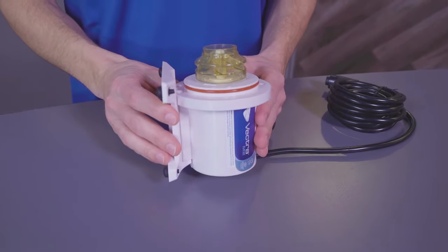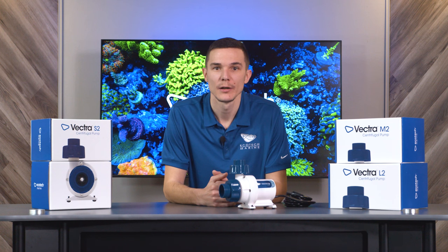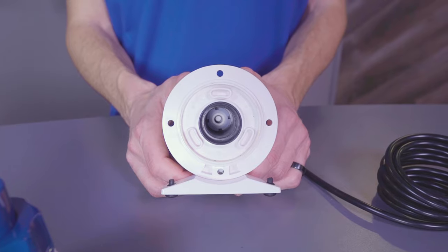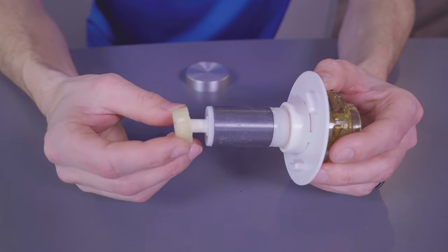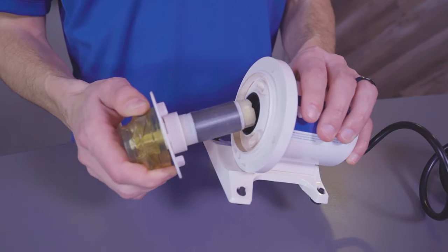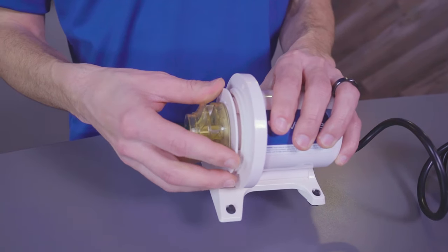If your pump is clean and you are still receiving a stall error after reassembly, please check the bearing in the back of the pump. To do this, you will need to disassemble the pump again by removing the four 5mm Allen screws from the pump, then remove the Volute and the impeller. The bearing is located behind the impeller towards the back of the motor. This bearing is directionally specific, so you want to ensure that you have the bearing seated correctly. Once the bearing has been installed in the correct orientation and fully seated into the back of the motor block, you can then reassemble the pump.